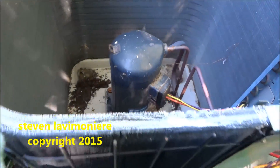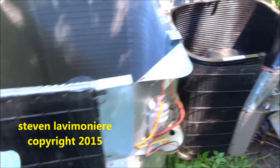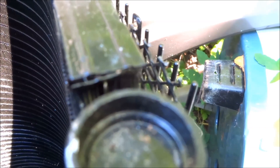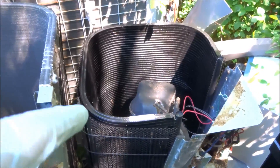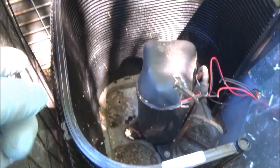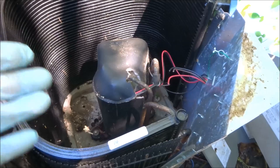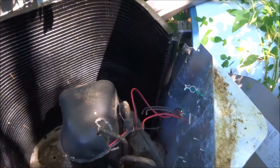This Goodman has a scroll compressor on it — some guys call it the 'brown turd.' And this one here is a micro channel coil. You can see it's kind of like a car radiator — there's no copper fins, it's got a flat tube, and that tube has like six or eight different small holes all the way through it, which is why they call it a micro channel. It's black because it was a replacement coil. That coil alone for a little two-ton unit cost eight hundred fifty dollars just for the replacement — what a piece of junk.